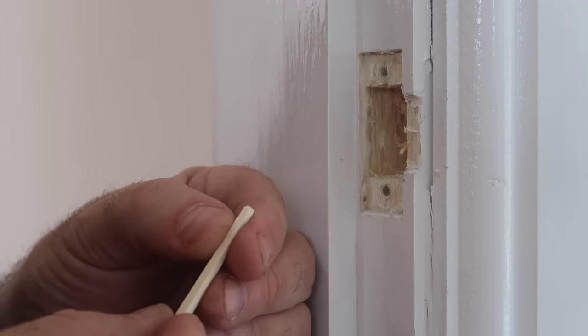I can now offer back up the plate and, using a bradawl — or in my case a nail — make a shallow pilot hole to help stop the drill from wandering. I start with the smallest drill bit I have and then enlarge the holes to the correct size for the screws I'm using. With the strike plate in its new position, I've got a nice positive click of the latch and hardly any play on it once it's there — a door that now works, which is really good.